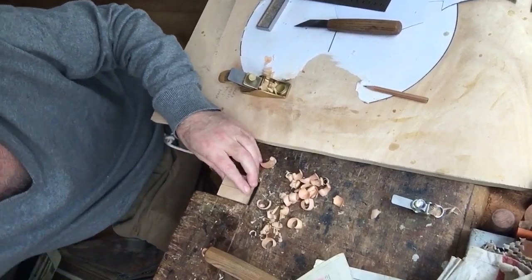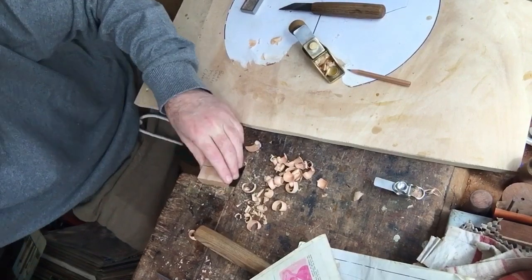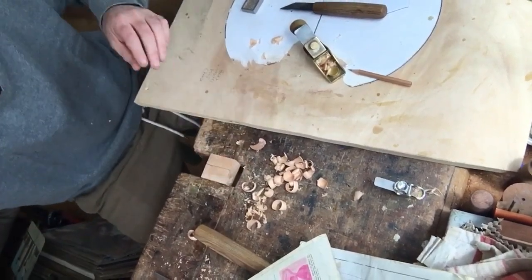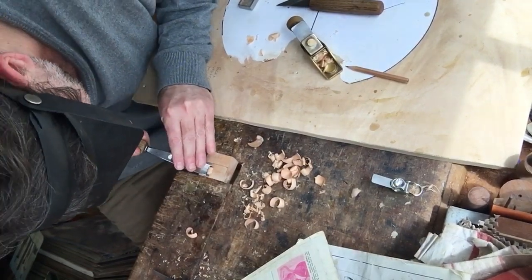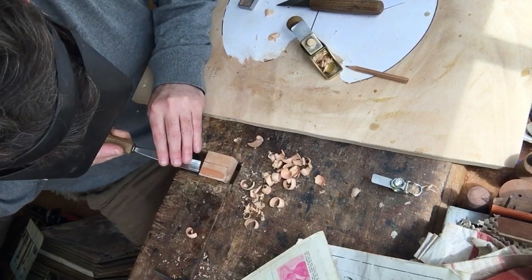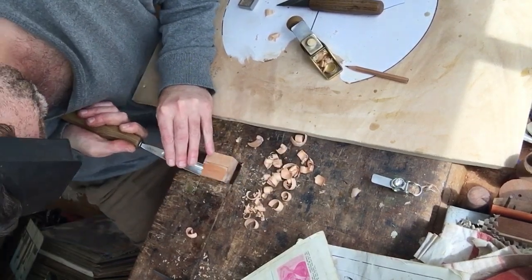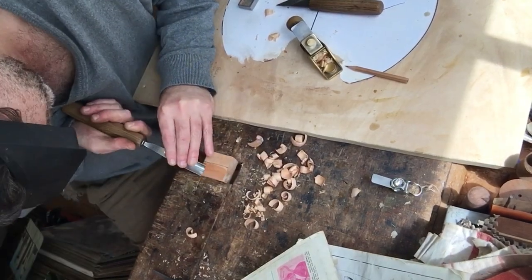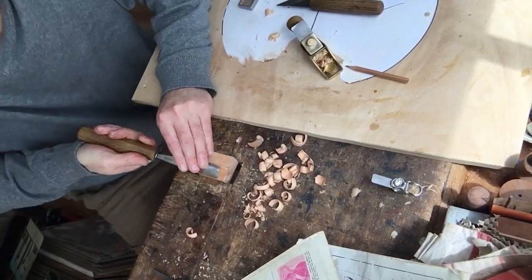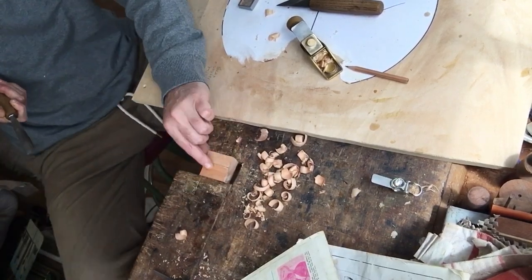You put the block in the clamp. There's a 50% chance the cutting direction is going to be correct — let's see... yes. Now you're using your gouge to cut the shape of the corner. You're trying to do a nice, confident cut that's even all the way across — you don't want to take away too much on one side. You can go right up to your lines using that guiding line you drew.